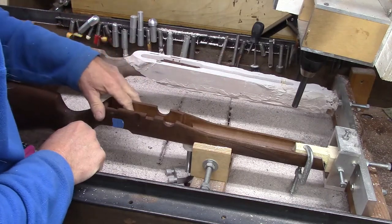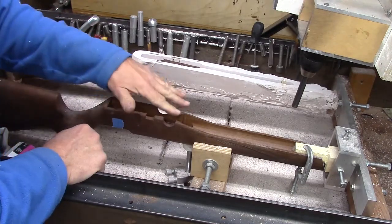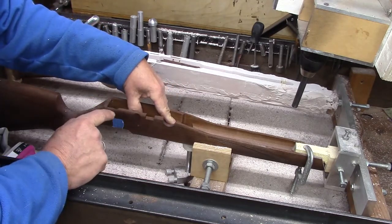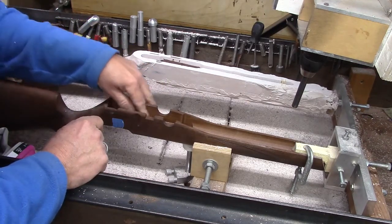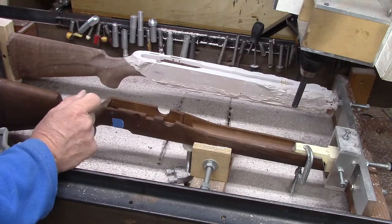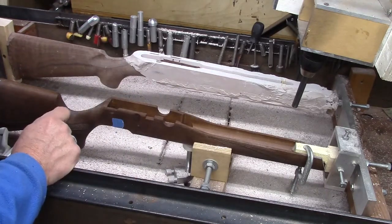And the back part of this inletting that the factory overcut, I have a plan on how to deal with that. I'm thinking about putting a piece of aluminum in on the flat section that is at the right height and set the router bit to be at the wood's height, if you get what I mean. That's my idea. So anyway, I'm going to work on cutting a piece of metal for that and getting that jigged up, and really looking forward to getting the round bit in there and cutting this round, and it won't take very long to get this done.